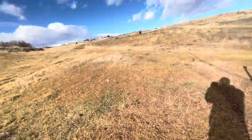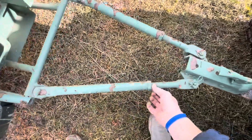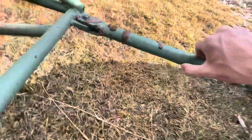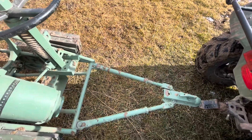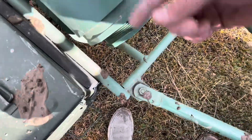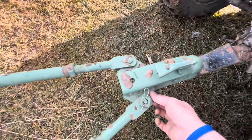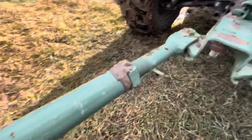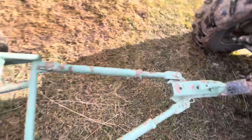These arms actually came off of that potato harvester all the way over there. I cut them off with a battery-powered grinder, and this is completely seized — they've been swelled, there's been water in there, they're actually cracked, and there's no way they'd ever turn again. So they're set at the length that they are, but they're just perfect for what I use. I welded the ears that were actually on the harvester — I just cleaned them up real good. And I took them and welded them onto a new tongue so that I could mount this with a separating tongue so you could have legs.